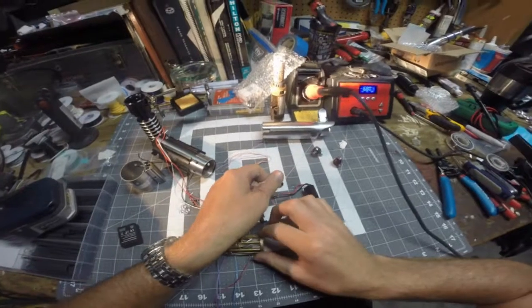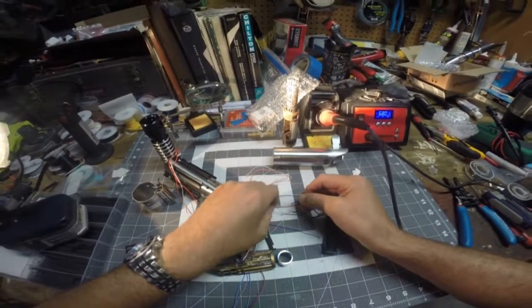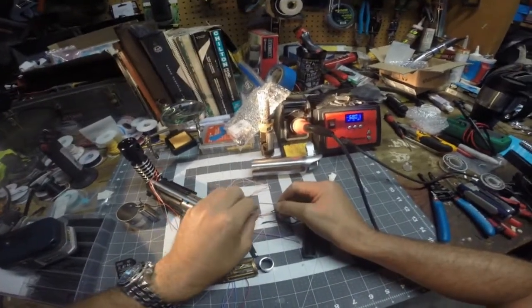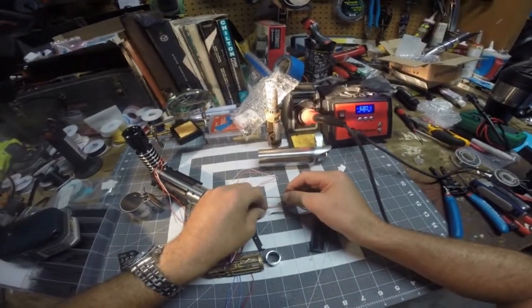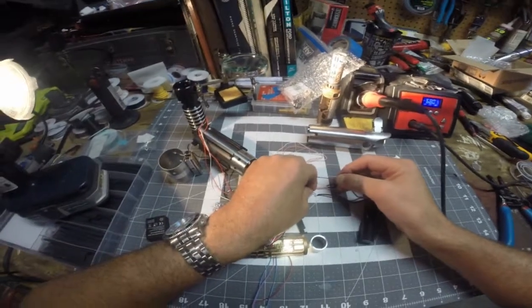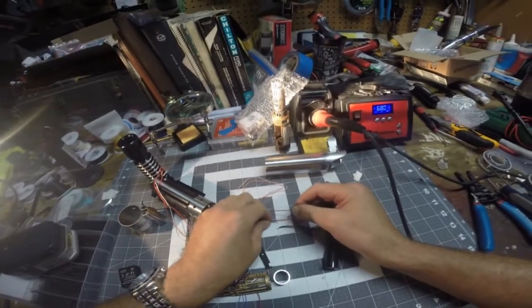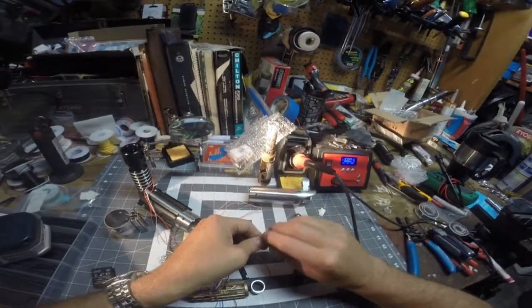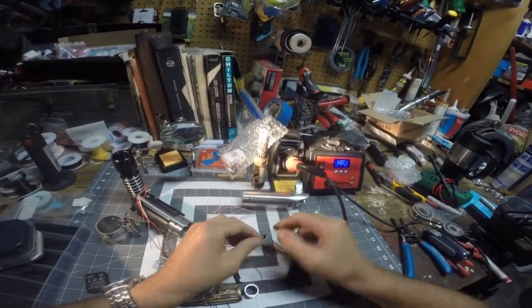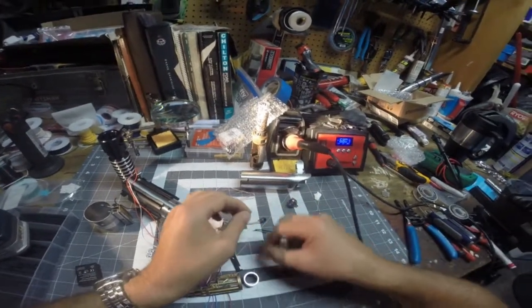Alright, so now I'm going to demo my crystal chamber so you can see it. There is the crystal chamber lit up with the blue LED. Now, this is an RGB LED. So when you combine green and red in the RGB, you kind of get a gold looking color, which I was going to use for flash on clash. So what I'm going to do is play around with the mixing, and I'll show you why in a second. Because on the Nano Biscotti 4, it's got a lot more mixing options,